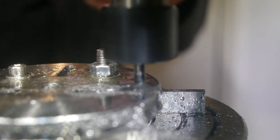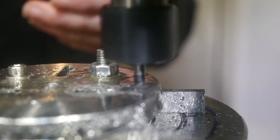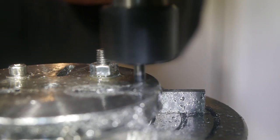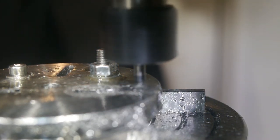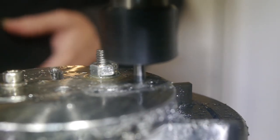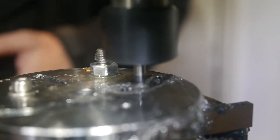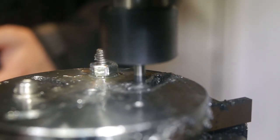In the original design, I sized the holes to ensure that the center of mass was located as close to the center of the spindle as possible to reduce vibration. The two symmetrical holes are out of place due to measurement errors, which has in turn meant that the slot geometry is a little different, so I'm going to need to update the design and recalculate the hole sizes with the right center of mass.